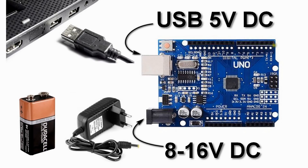The question is where to connect the other end of the push button. Let's have a look at how the Arduino is powered — it has two options. One is to connect your USB cable and it will work on the 5V from your computer. The other alternative is to connect a 9V battery or an 8 to 16V power adapter to this input. You can safely connect both at the same time because there is a switch on the board that prevents the adapter power from damaging your computer. If you power it from 8 to 16V, onboard circuitry will bring that back down to 5V because the processor operates on 5V.